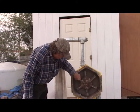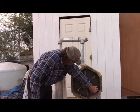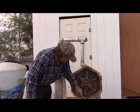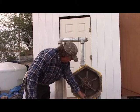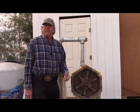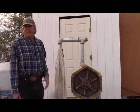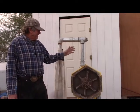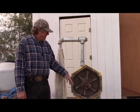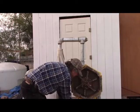Another thing you get is a lot of dead bedding. You can see these impactors are a little bit worn — they're kind of away from the housing a bit — so you will actually get a layer of fine material in here, and that's what they call dead bedding. It just sits there and doesn't move. It's undesirable but not terribly catastrophic. This is not really a production unit; it's more for test size, and as such we just clean it out after each run. Now let me put it together and show you how this works.